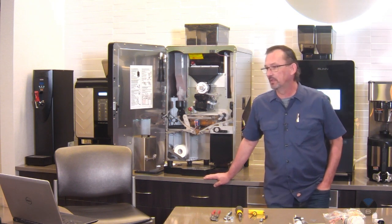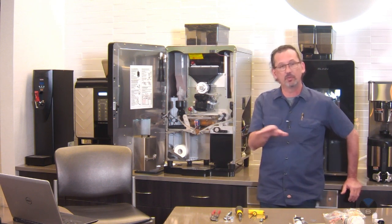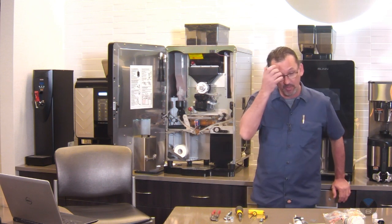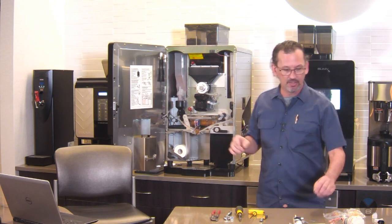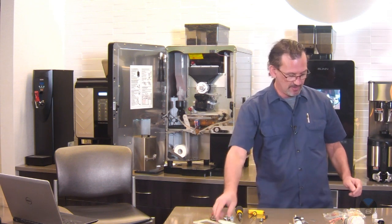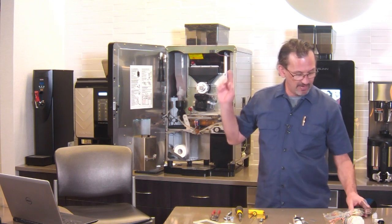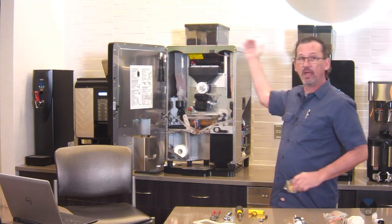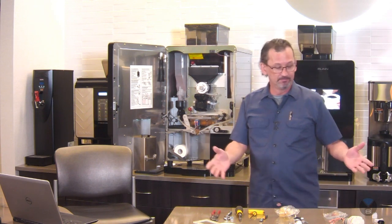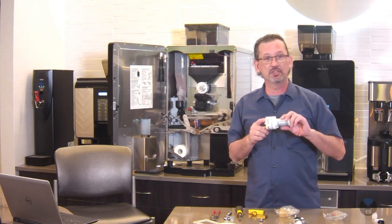How often should you do a PM? Oh, I'm not seeing the questions here. We have a 6-month PM, and what we just showed you today is a 12-month PM. But the video on the 6-month PM is available also. It's basically everything except for the tank lid gasket, the brew screen, and the valves in the back, the valves along the back side. Everything else is in the 6-month PM, same as the 12, including the vacuum pump. This does get changed every 6 months.